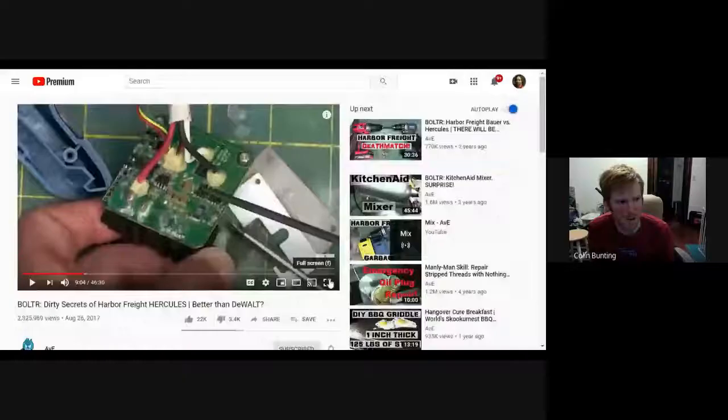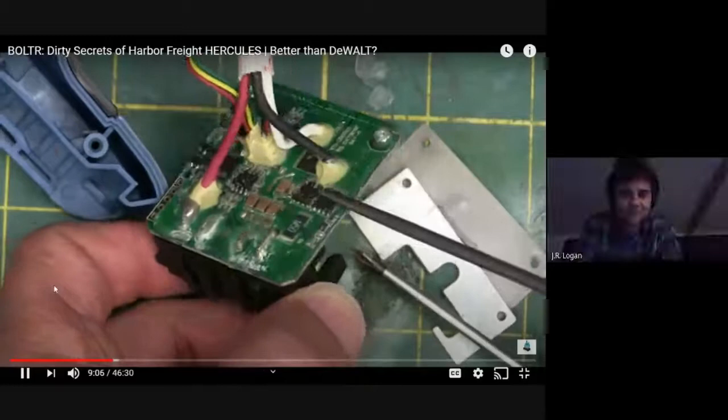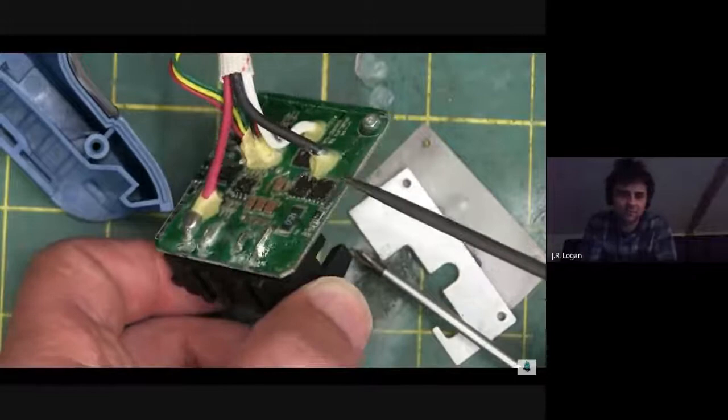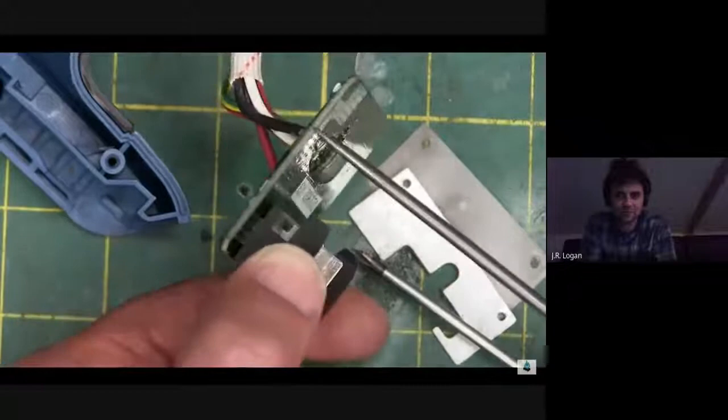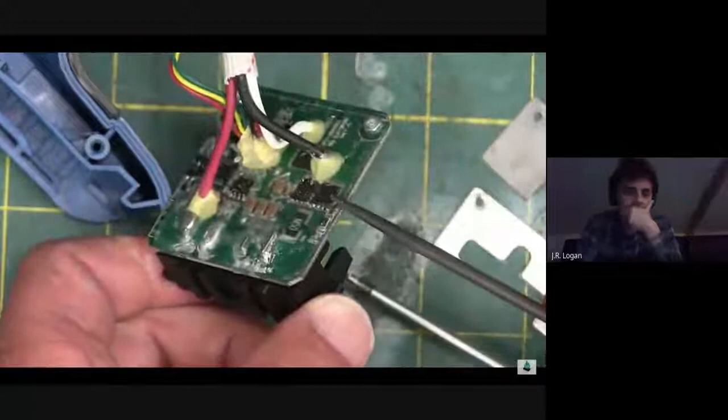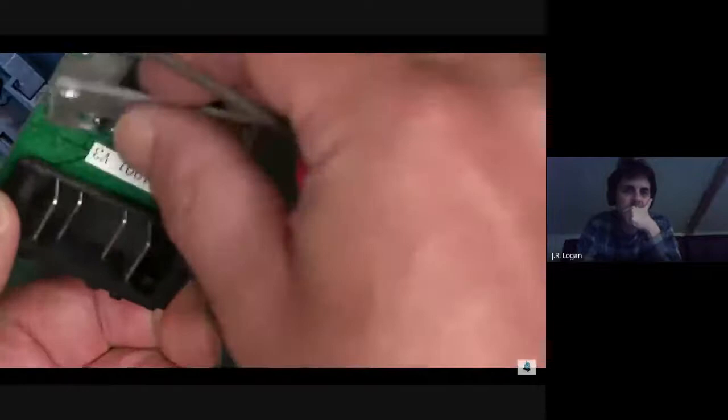The switching in this drill, and we see what they're expecting. Instead of putting a heatsink directly on these, and these two are just tiny little packages, just babies, they're expecting this heat to sink into this copper layer through the holes in the board via the vias, through this heat transfer membrane, and into the heat sink here. So here are the MOSFETs. These are what's getting hot. And over here, floating atop this membrane is the heat sink.